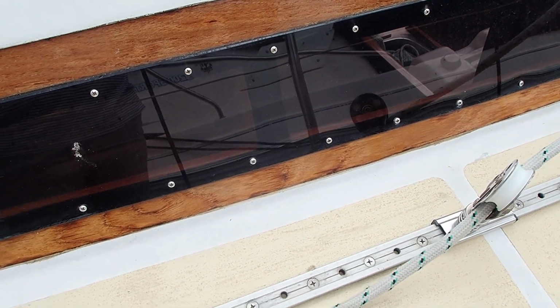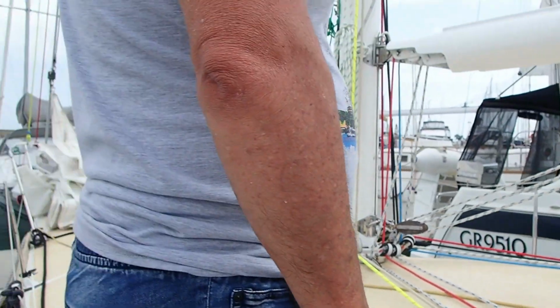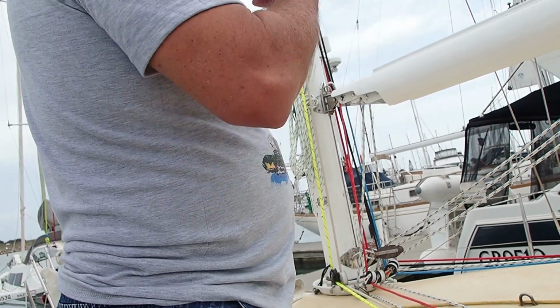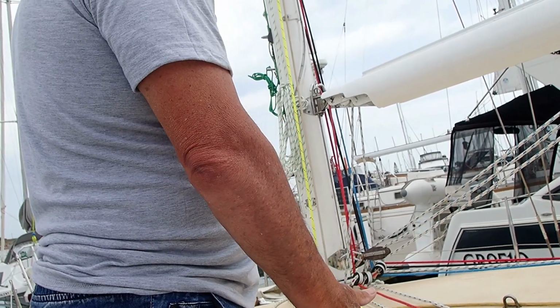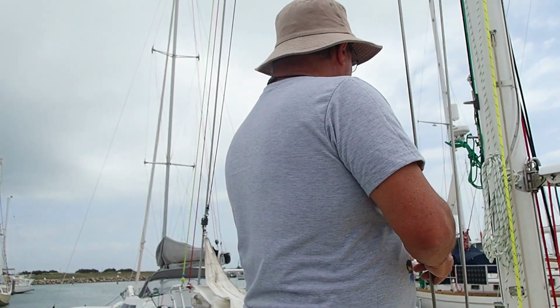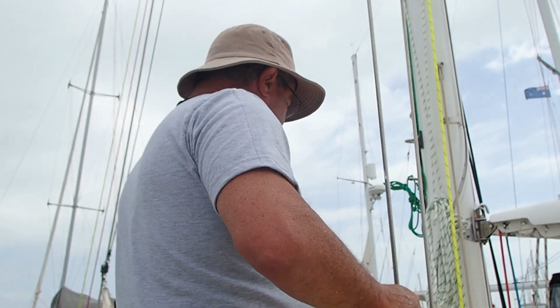Oh, okay. So, because this is quite a big sail, being about 110%, when it's fully on the wind, close hauled, our headsail comes back past our spreaders. So that's why it's called 110%, because it goes past the mast, is that correct? Yes. From your spreaders forward, or your mast, is 100% headsail.